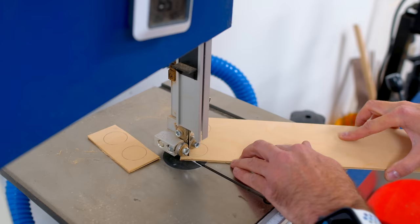Number nine is the domino, and that uses the Festool domino joiner — it's like the biscuit joiner except it uses little wooden tenons, not biscuits. The cool thing about the domino is it's super expensive, but it doesn't cut a huge slot like the biscuit joiner — it cuts a smaller slot. For the biscuit joiner you have to have a picture frame that's at least two inches wide; with the domino you can have narrower picture frames. Now we're using my frame clamping jig — I've got a video on this really cool, clever jig that's been around for decades. That came out really good.